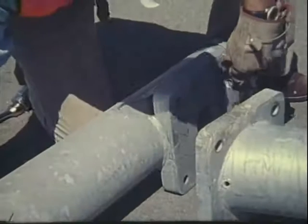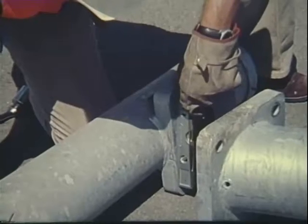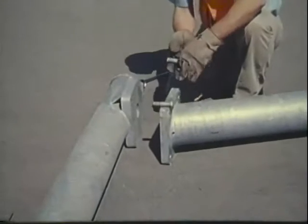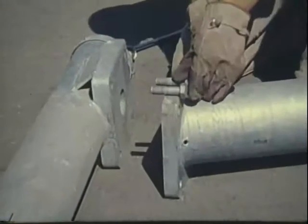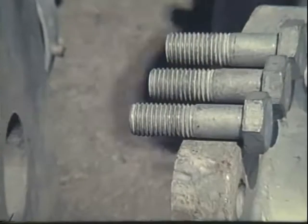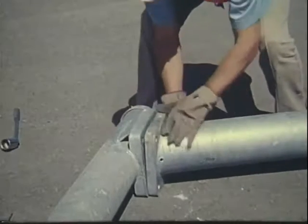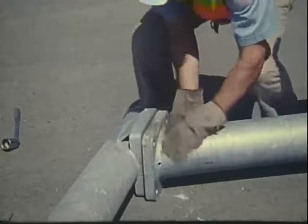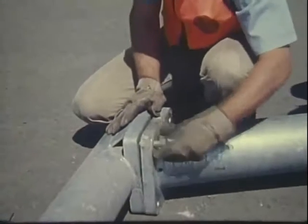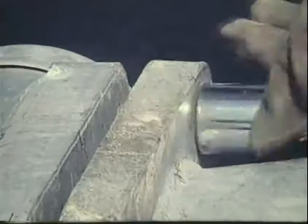The mast arm is first bolted to the pole. The mating surfaces on both the pole and mast arm should be flat and free from high spots or lumps of galvanizing material. This will ensure even bearing and prevent loss of cap screw tension. Check the length of the cap screws which are used to fasten the mast arm to the pole. If the unthreaded shank is too long, the cap screw cannot be tightened. If the overall cap screw length is too short, then there won't be enough threads engaged to carry the load.